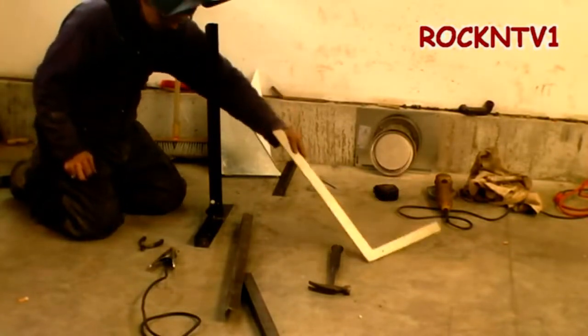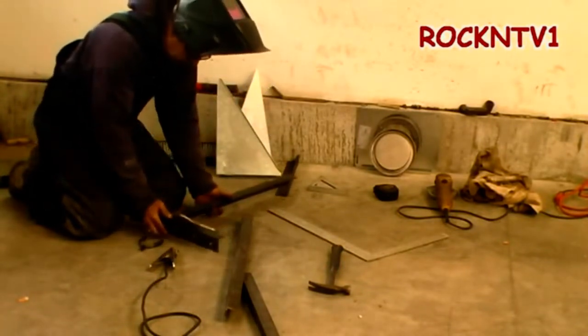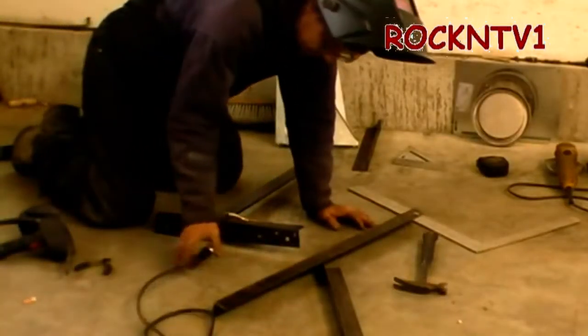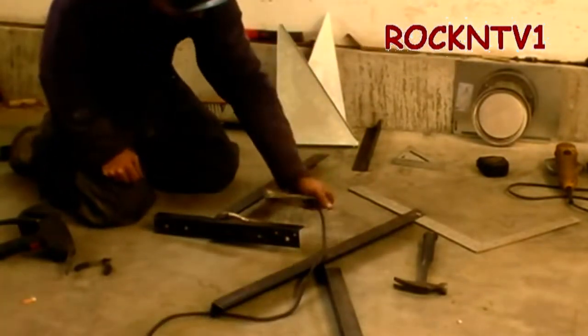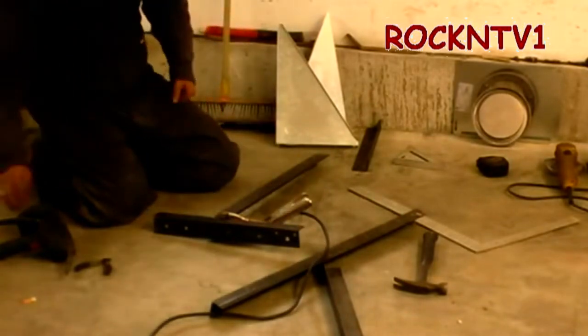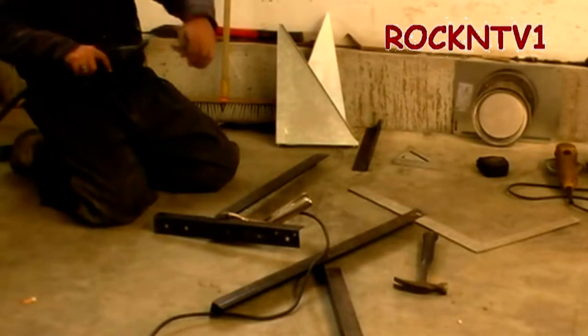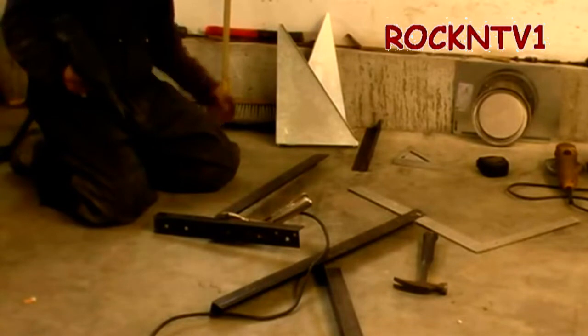Check them with a square. We're going to do a couple of tack welds to make sure that she's on there. We'll clamp it on the clamp. Using 0.030 wire on this here little shank. We're going to hit it, check the square, hit it, and it's a model.